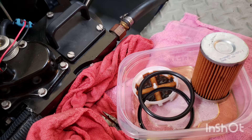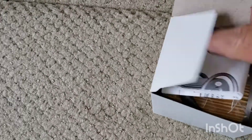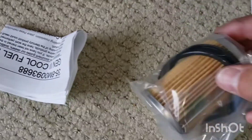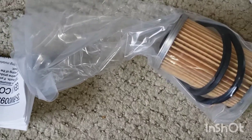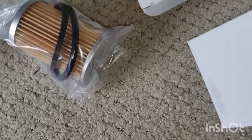In this video, we'll be replacing the fuel filters on a 2006 MerCruiser 6.2 with the Gen 3 Cool Fuel Module. Part numbers for these kits will be included in the description. The main filter kit comes with instructions and the two required O-rings. The filter disk is also needed for the Cool Fuel Module.